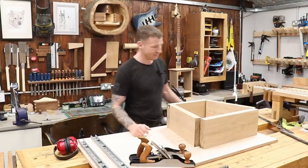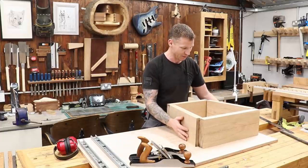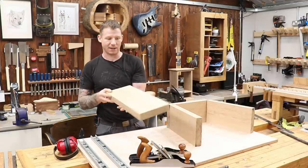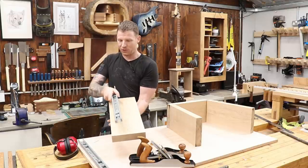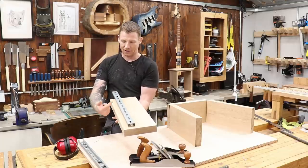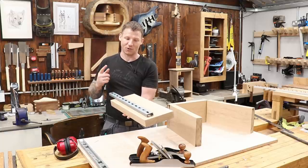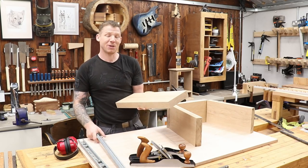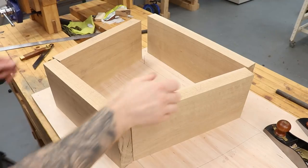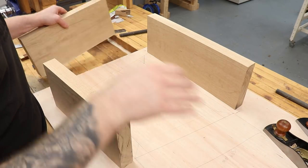The legs will be made from oak. I have these pieces machined up already and we're going with a trapezoidal shape. These are two legs together so I have to split them all in half. The plan is to take the top piece of the leg, split it in half, route the unistrut and sink it into the legs — it'll be fixed to the table and the leg can be screwed to the unistrut, giving a really strong attachment point that should also help keep the table flat. Here's a close-up of the legs — just some two-inch oak, already machined up.